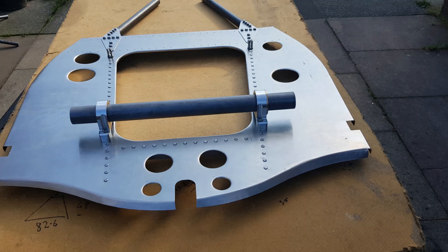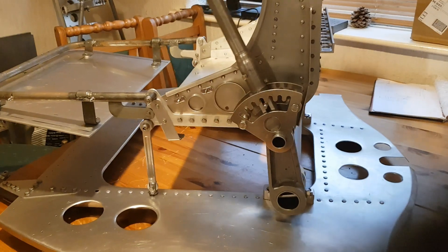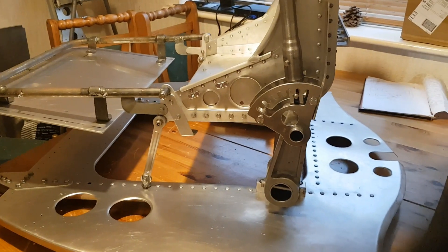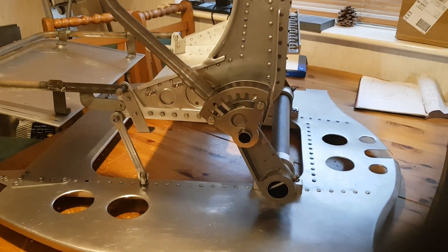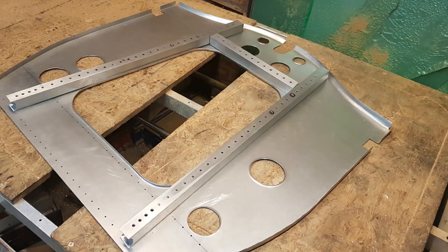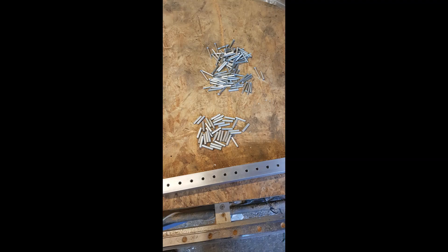The bulkhead provides for the forward connection of the accumulator tray. The lower edge of the bulkhead forms part of a complex connection between the fixed lower fuselage skin and the detachable forward-facing alcove panel over the Fowler flap in the centre wing section. Image 10 shows the bulkhead located between the CNC profiled former and bolster blocks ready to form the internal and external flanges. Image 11 shows the formed flanges and the layout of the box section support chassis required as the main foundation for the pilot's seat. Image 12 illustrates one of the many unseen components in the construction of an aircraft — the box chassis is reinforced with a large number of distance pieces required so that the riveting does not crush the chassis.